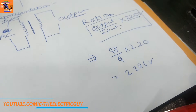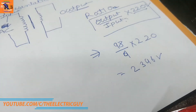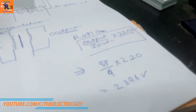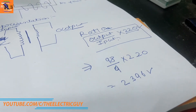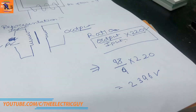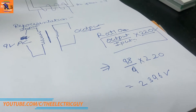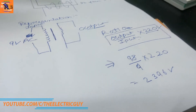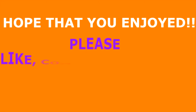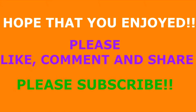In this way you can find how much high voltage is actually produced by a high voltage transformer. This could work with any kind of transformer — just lower the input voltage until the output is measurable, find the ratio of output to input, and multiply it with the original input voltage to get the real high voltage value. I hope you enjoyed this video. Please like, comment, and share, and subscribe to stay tuned with my upcoming videos.